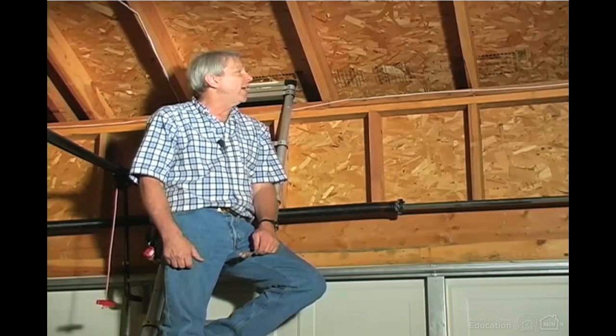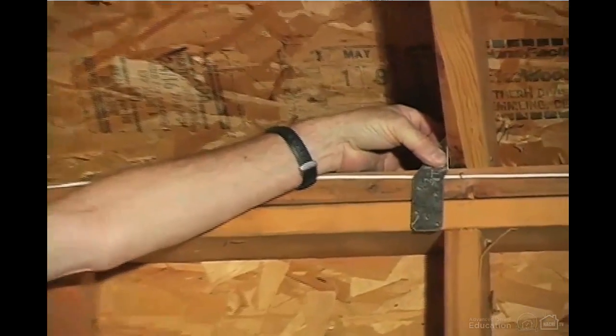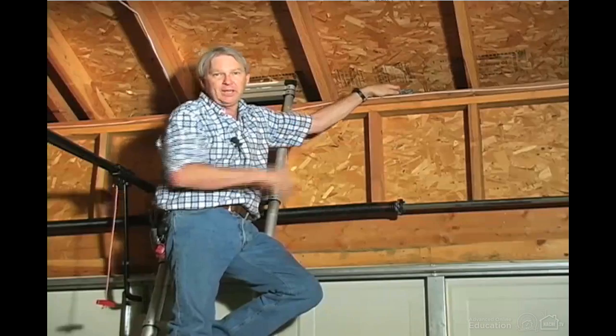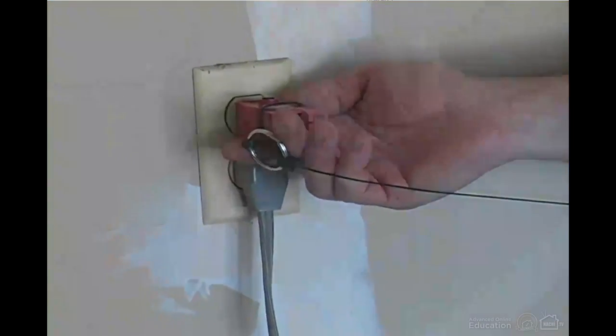Homes built to modern standards will require metal connectors fastening roof framing to wall framing. And this is what you'll typically see, and they'll go on one side of the rafter just like that. They're typically installed every other rafter except at the corners. The rafter 4 feet in will have one on both sides.